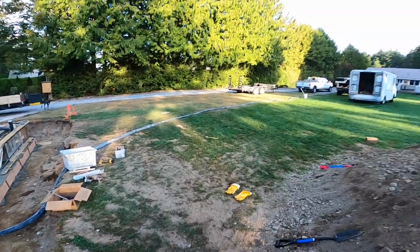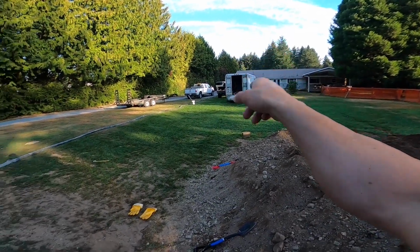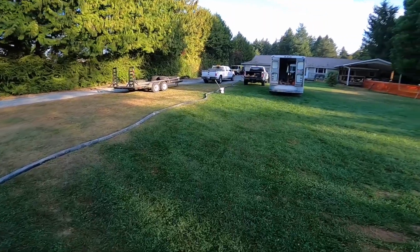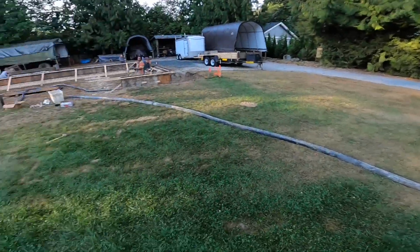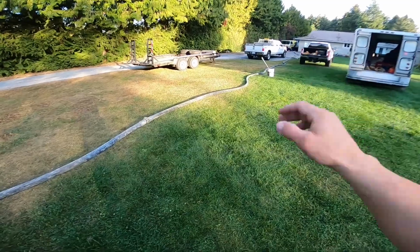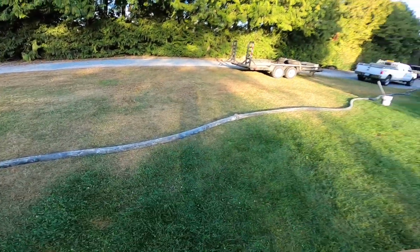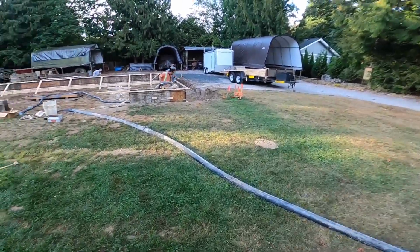Do not introduce a whole bunch of water into the hopper just before you pump down. The reason being, doing that, you can end up with a segregation plug in the hose. You go and put your air on the lines and crank it up to 80 psi and you've got a rock pack in the hose. Major problem. So if you're going to wet things up towards the end of the pour to blow the lines out, do it at the mixer and let that gradually introduce. Don't go back and rinse the sides in on your hopper and make a lake in there and then try and push it part way through and finish it with air. That is a bad situation.